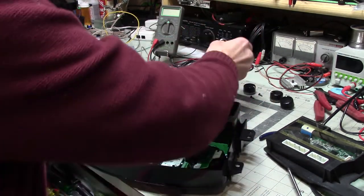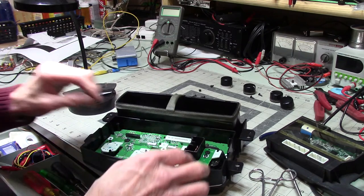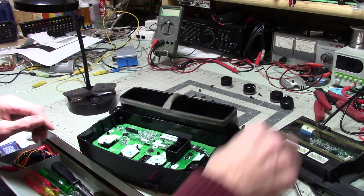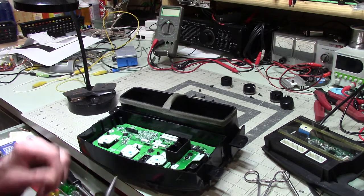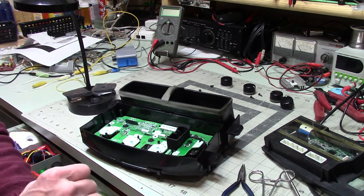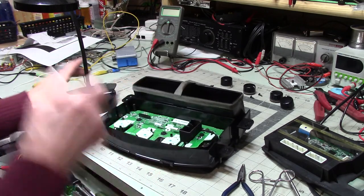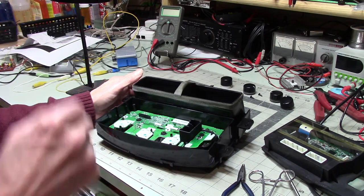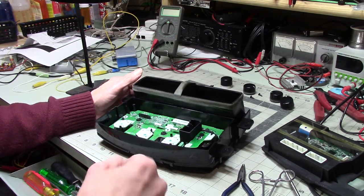So, I'm not sure what the economics is, how do they decide what makes more sense? But you do often see, well, actually it makes sense. Say, take for instance your car. When you turn your ignition to the starting position, the connection in your ignition switch that activates the starter isn't handling all that massive amount of current that the starter is demanding.